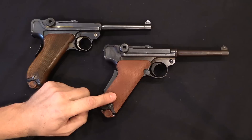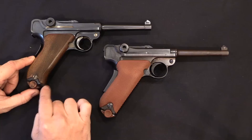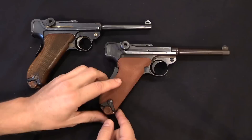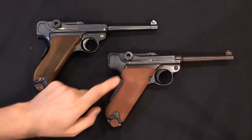There are a couple of elements that allow you to identify these from a distance very easily. Most distinctively, the front strap here is entirely straight. On the original Luger there is sort of a lump, a toe at the bottom of the grip. That was gotten rid of, so you can substantially simplify the machining and tooling needed to make these. The front strap itself is also a little bit flatter — there's less of a curve to it than you had on the original pattern Luger.